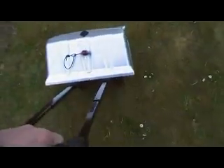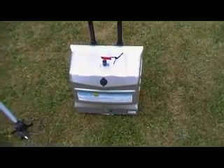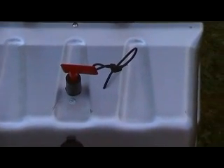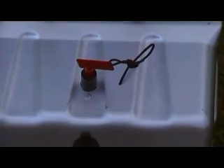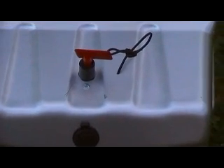This is the Aversa out of the truck — it's on wheels, just like a little suitcase, really convenient. Let's open the trolley up and show you the modification I've made. On the front you can see where I've put a 12 volt cigarette lighter socket — that's where my solar panel plugs in, which goes straight to the positive and negative of the battery. I've also fitted an isolator switch that cuts the power from the inverter to the battery, so when I plug the solar panel in, charge goes straight into the battery.